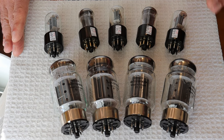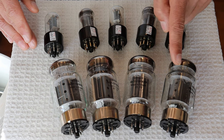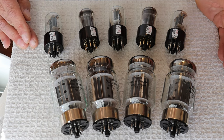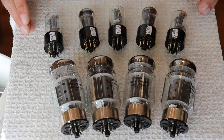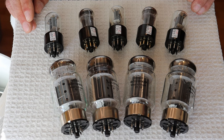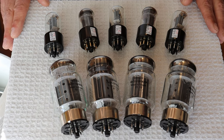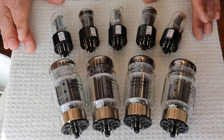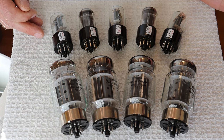You may have a single 12AU7 or something like that doing the phase splitting duties as well as driver duties. It's pretty common to do a circuit topology in which one tube per channel — like a 6SN7 or a 12AU7 — drives the signal up and splits the phase as well. That preamp tube is absolutely critical, but the driver tube is quite important as well. You want something that's a robust tube, and if it's phase splitting, you want the sections to be tightly matched, or it's going to affect the sound. And in fact, this is a set that came out of the R8 that you just used to drive some beautiful EL34s.